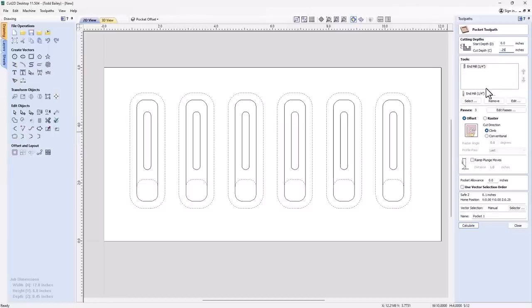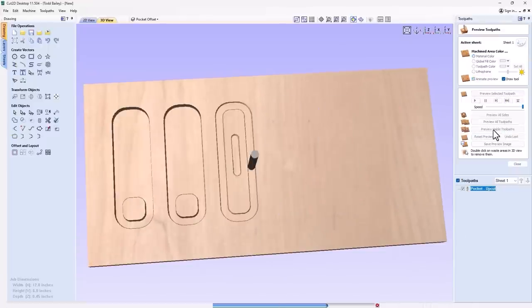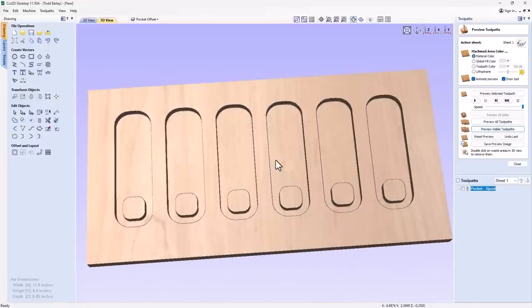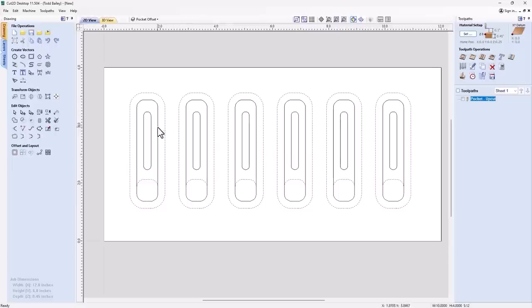Except my plan is to use an upcut bit. I'm not gonna use a compression cutter like normally we would do in plywood. I'm going to be a little bit lazy because I know that these are going to be very basic things and we're going to replace them often, so I'm not going to worry about things too much. This might come back to get me in the end because the top edges of these will be a bit rough looking, but we'll see how it goes.